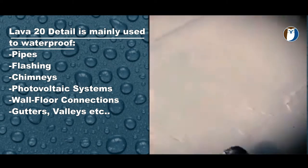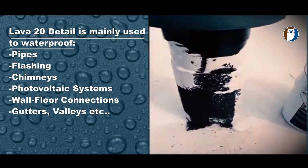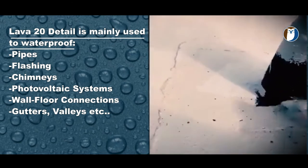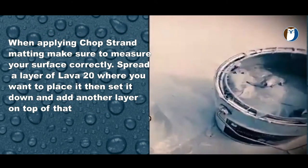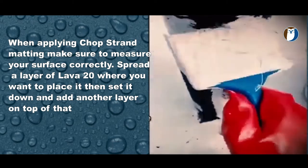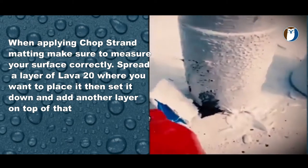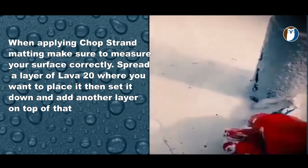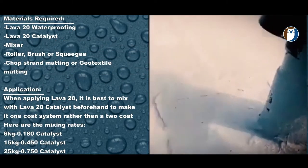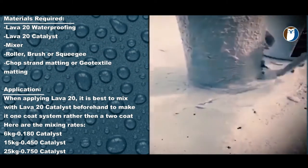This is a felt balcony, which is going to be given the anti-slip finish over the Lava 20 waterproofing system. Care is given to all roof details, transitions, joints, corners, etc. during the reinforcing process before coating with Lava 20. Here you can see an example of all the details on a roof